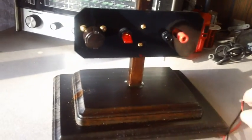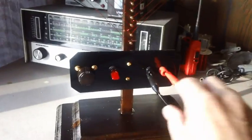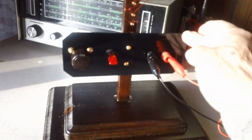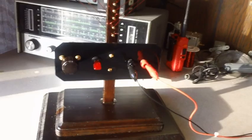I've got the antenna hooked to my Philco 630B. The red wire goes to the antenna on the chassis and the black wire goes to ground on the chassis. The reason I'm using gator wires is because if I were to use banana plugs and they push in too hard, they would snap that off — that plastic is awfully thin. So for now we're going to have to use gator wires, but I'm certain they'll break it eventually and bring it back, and I'll go ahead and fix it.